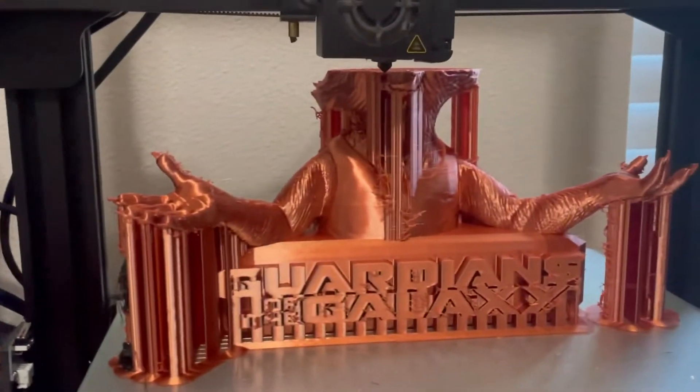By doing this method the PLA was extruded out and I was able to fix and rebuild that whole support, essentially saving Rocket's finger. Turn your feed rate down 20 or 30 percent, slowly put some hot glue in there, let it build up, and monitor as the nozzle comes over to make sure it's sticking. It caught that edge and was able to completely rebuild and reprint that support, saving the print. It's looking pretty good — Rocket's got all five fingers. We're at 83% with maybe five or six more hours to go.